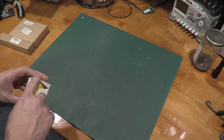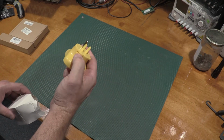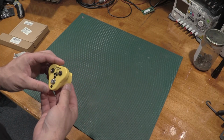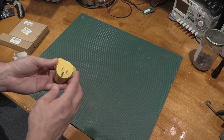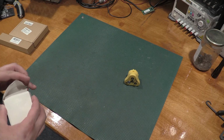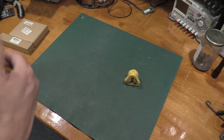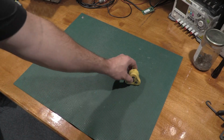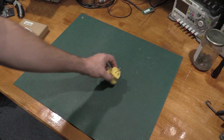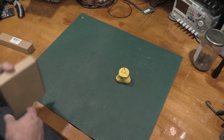But first things first, we have a grounding plug. So I am going to get a better grounding solution than this eventually. I don't have time to poke holes in the wall, run a true grounding strap to a ground rod out back, sink a couple of ground rods, make a really solid ground connection. We will do that at some point. I just do not have time for that right now. So I am going to be using the ground pin through the electric panel, which is bonded to a ground rod out front, outside, and is good to go there.